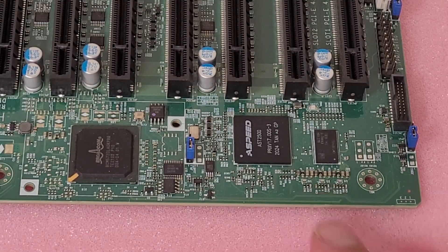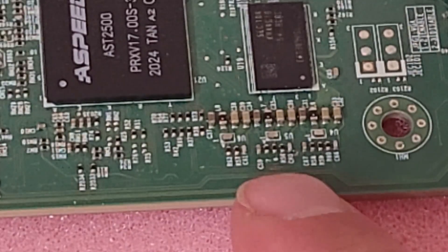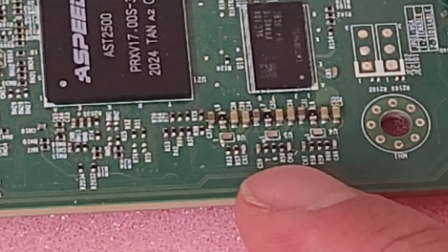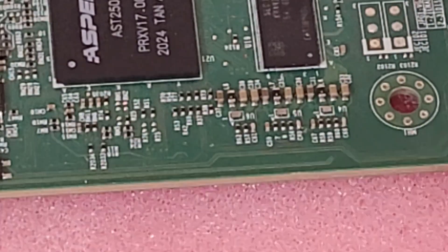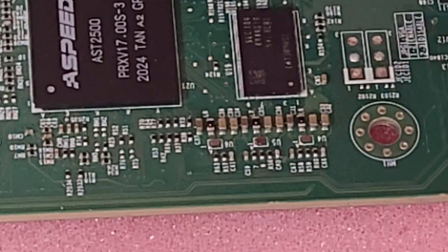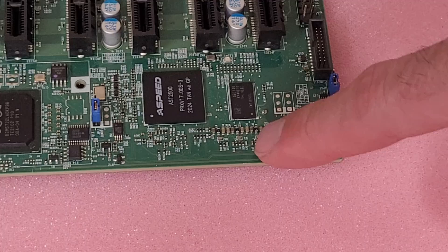Also in my case, there's physical damage to the PCB. There's some lettering that's supposed to be there for marking the components — I believe those are resistors, it should say 'R something' there. The solder mask above some of these traces has gotten scraped. The running theory is that's because it's in such close proximity to the PCI slots, and someone was being careless and scraped the board.